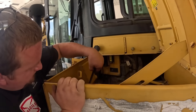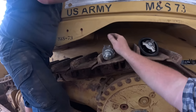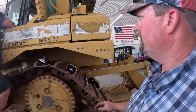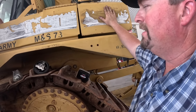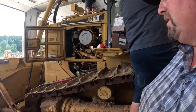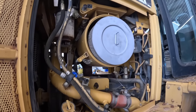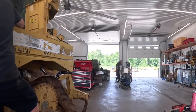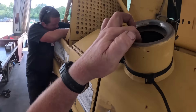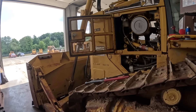Kevin's got a new end on the battery cable. I've got a new disconnect switch. That one's stuck from sitting. I'm gonna go order some fuel filters — tank is dry. I'll order an oil filter and probably cut that one open. I did just put a pipe wrench on the fan and got the engine to turn a little bit — that's a plus. The fuel tank's not rusty but looks like it may have had water in it. There's water standing inside this lift right here — left the cap open and sucked water in.